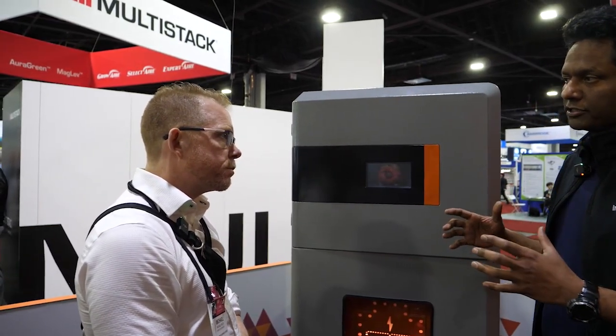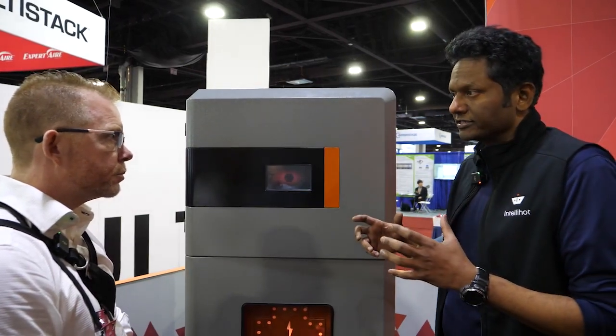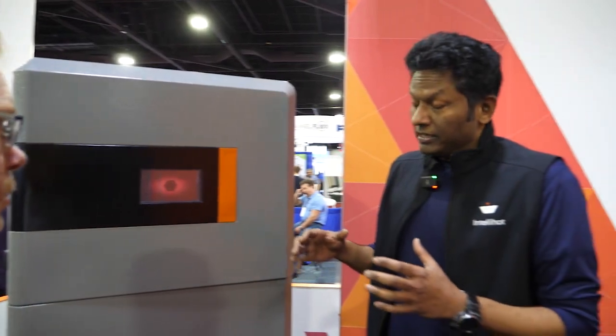The battery itself is a mixture of water-glycol mix. We invented a really cool glycol concentration sensor that ensures they're keeping the right concentration of glycol. The heat exchanger is all stainless — a single stainless steel tube that sits inside. It has high turbulence and it essentially heats water to the right temperature as soon as you open the faucet.